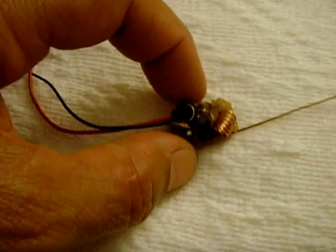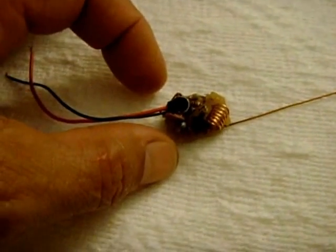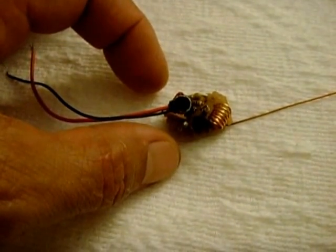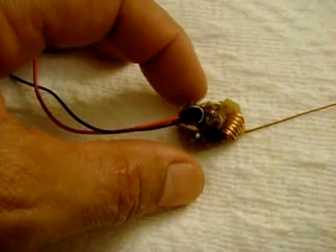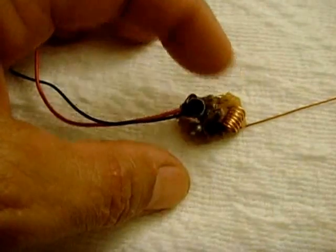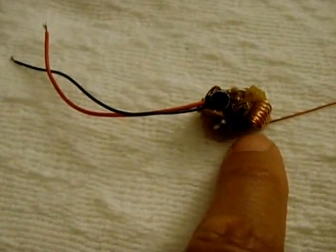I have the schematic in the description box. I chose to use an MPSH10 transistor; you could also use an NTE229. The frequency range can go way up high, so you want to choose the right coil for your tank circuit along with the capacitor. In my schematic I use a 15 pico capacitor along with a six-turn coil.